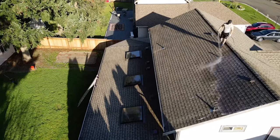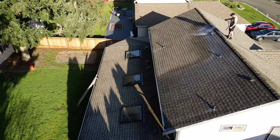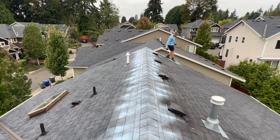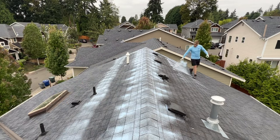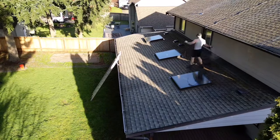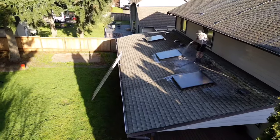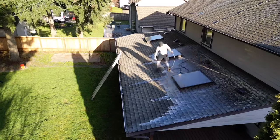When it comes to treating and washing a roof, there are a couple different methods. The best and most premium level is definitely the soft wash, which is what we're doing now — it's a mixture of bleach, water, and soap, and it kills everything in its tracks and makes the roof look the best. The other option is the zinc powder treatment or laundry detergent powder, which is essentially a powdered version of the soft wash but needs water to activate. It rains so much here that we'll just powder the roof and head out — it's a lot faster and the materials cost less. It really is up to the customer if they want the spotless-looking result with soft wash or the more cost-effective powder treatment. The soft wash generally adds at least $200 more to the cost, but many times it is definitely worth it.